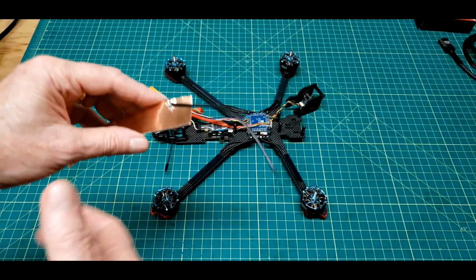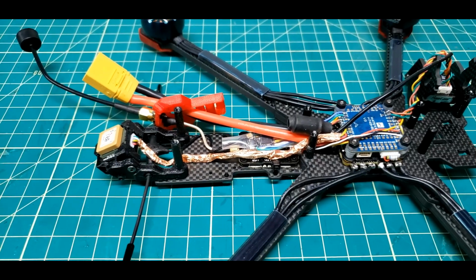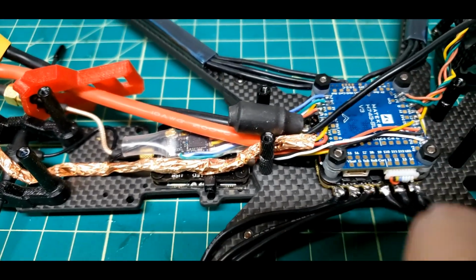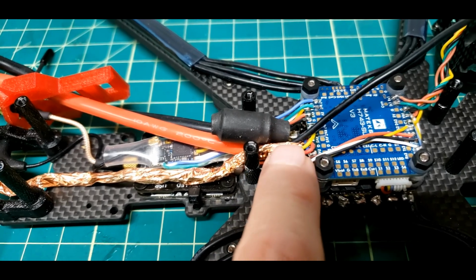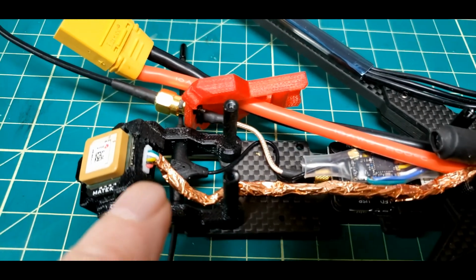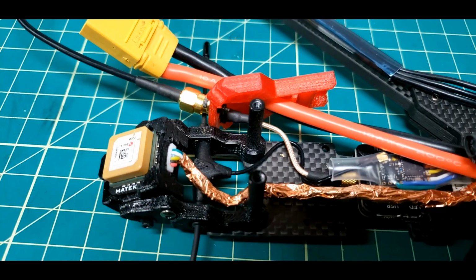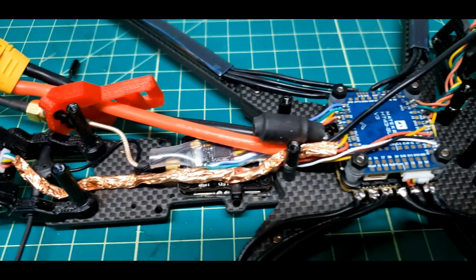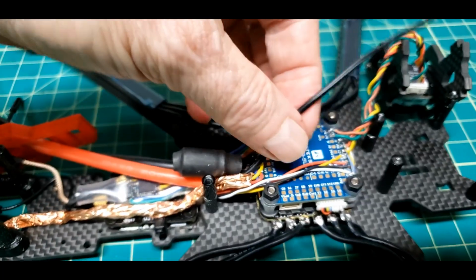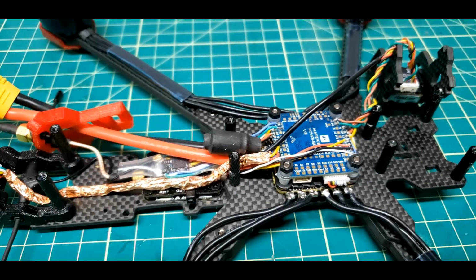So I'm going to do this off camera, but I'm going to wrap that wire in it. Well, there you go. It's not beautiful, but I think it is functional. I didn't get the shielding as far up on the wires as I had hoped, front or back. But they are back enough from the metal in the end of the wires where they won't short it. Now I have to figure out where I'm going to ground my drain wire, cut it, and solder it down.